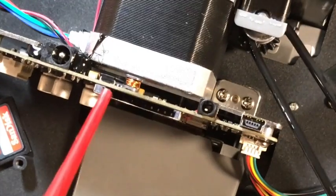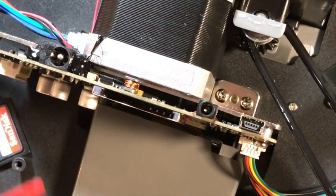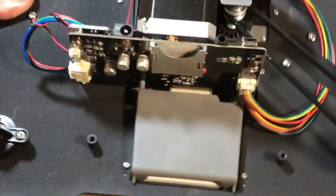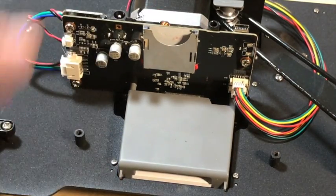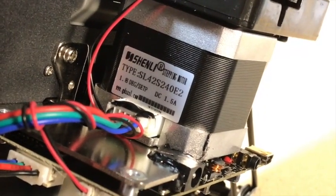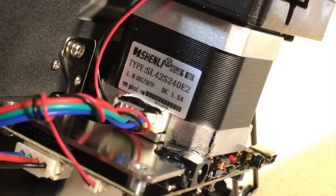Here's the memory card, there's the motor, and that gap is the gap between the motor and the belt. Very slim. Somebody asked where's the heat sink — well, the heat sink for the motor apparently is everything else. We'll let the circuit board dissipate the heat for us. This is the stepping motor — uses one and a half amps, which is a pretty good load for a wall wart.